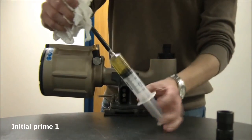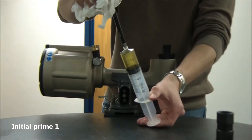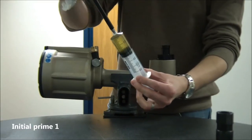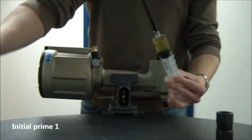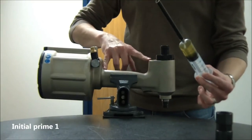Try to make sure there's no air in the syringe or the extension — just push any extra oil out until you can feel some in the rag, so you know there's no air in there. When you've done that, do that with the other syringe and put one in each pull bleed port.